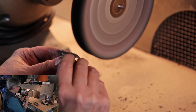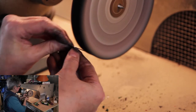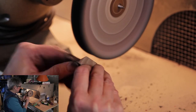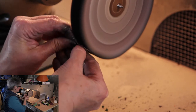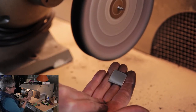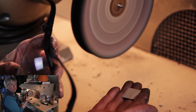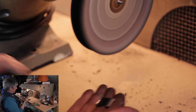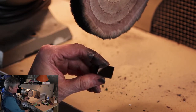I'm being successful in lightening up those lines, though I am having a little bit of a problem with compound sticking — I'm sliding the compound off on the bottom edge. Looking good — that's looking great. I do have lines; if I had an even softer buff, maybe a chamois buff — chamois leather — you can also use compound on it for buffing. But I'm pretty content with that. Of course I'm going to wash it, then have a very good look at it and really see if it is done — not just have it be wishful thinking.